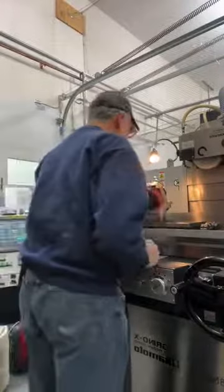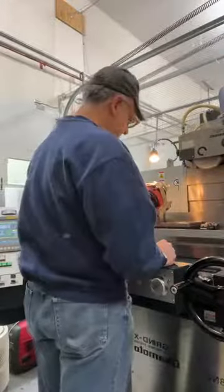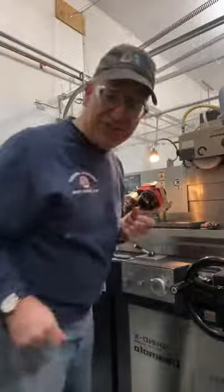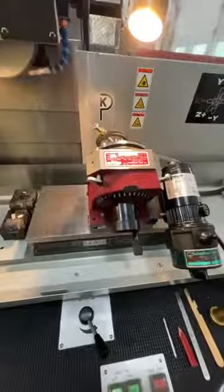All right. So I'm going to pull the pin out, make sure we're not hitting anything here. And just to make my point, you check, recheck, double check. There's the clearance of that bolt to the sine plate. If you don't pay attention to that, you could end up with disaster. So just check, make sure everything is good before we apply any sort of power.